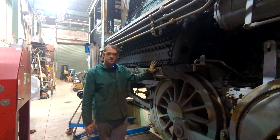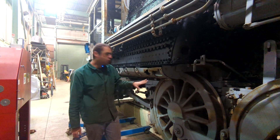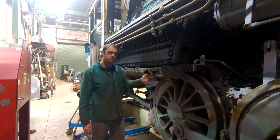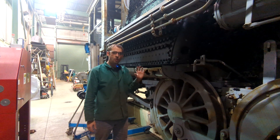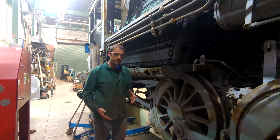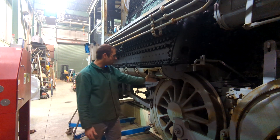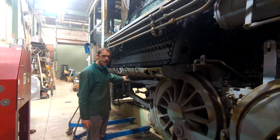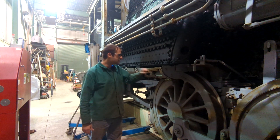We're just about ready to drop this ash pan down from the locomotive. A couple of things to go over before we actually drop it: before you get everything ready, you want to make sure all the hard bolts or nuts to cut off have already been cut off so you're not underneath something while doing it. That's all been taken care of — all the hardware underneath has been cut off. I just have a couple of nuts here that need heating and removal. I also have a duct jack underneath to catch the weight of the pan when it comes off, and I'll be using a pry bar and some different tools to get it off.